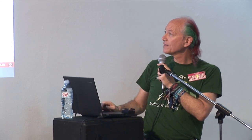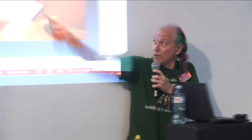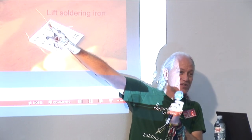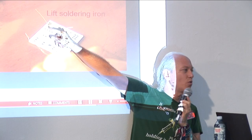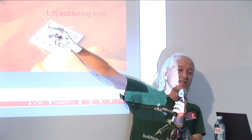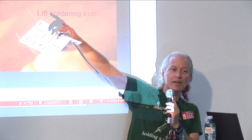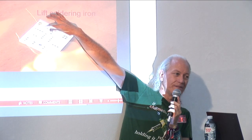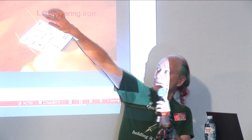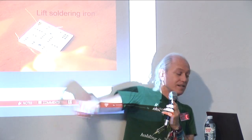Oops, what's happening? So if there's too much solder, the blob of solder connects two pads together, and that's a connection we don't want. If that happens, I can help you fix that, but normally what I do is I clean the tip and then scrape lightly between where I don't want solder, and it usually just pulls away with the tip, and then you can bang it off. But if you have any trouble with that, just let me know. I'll help you fix that.